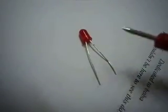To identify the terminals, we take a multimeter, connect positive to the positive terminal and negative to the common. Take the two leads of the multimeter and test: this is positive and this is negative. If the positive of the digital multimeter is connected to the positive of the LED, and the negative of the digital multimeter is connected to the negative of the LED, this LED will glow. If it is not glowing, we are connected in reverse, or this LED is not working. Now take the reverse connection.